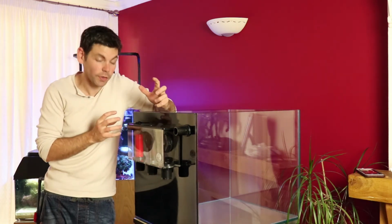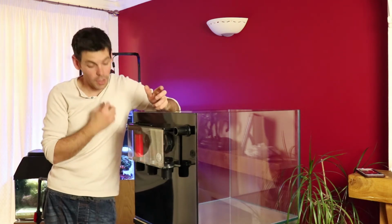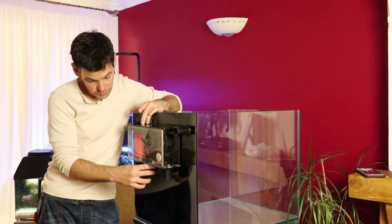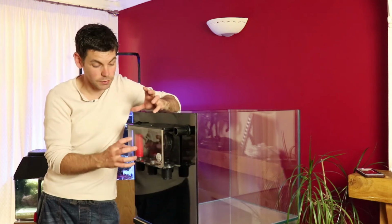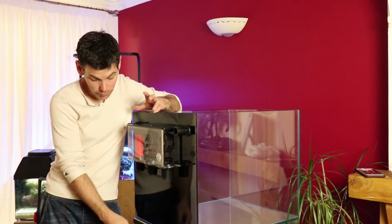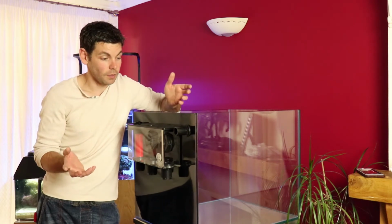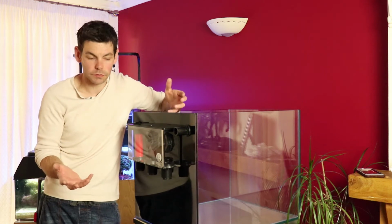So that's those 2 pieces fitted. Probably one of the easier jobs that we're going to be doing today. But now we can start working out how thick a piece of pipe I need to cut in order to fit the elbow onto the back, and then in turn where I want the reducers to be, and then we can continue on down into the sump. But before we do that, I'm going to be running the drain lines because that's a pretty straightforward affair. There isn't any T-junctions or anything like that to be put in, so this is quite a simple process. It's just going to be a down pipe. It's going to go with an elbow underneath the tank and then down into the sump, connecting to the gate valve. This is going to be pretty simple, so we'll start with that, and once those lines are all in place, we'll then be able to run these accordingly without getting in the way of the returns.